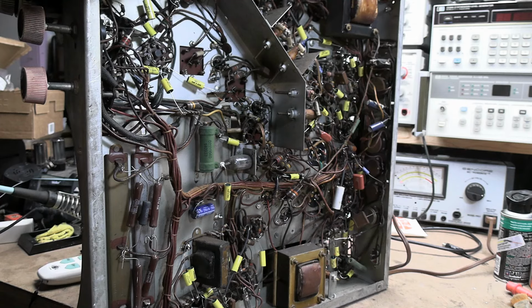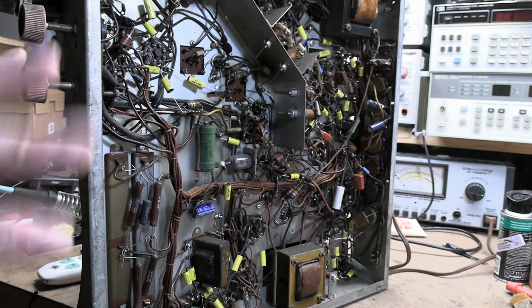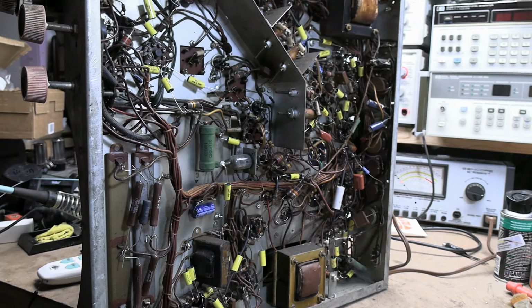The end effect on the screen is kind of neat. I'll show it to you later when I get the set connected up to a signal source, but other sets, when you turn them on, the screen will slowly fade in, it'll take a while to synchronize. This delays power until everything's warmed up, so when the relay clicks, you get a good picture, it snaps in almost instantly. Full brilliance and locked in, so kind of a neat thing. But obviously when this set's really cold, you've got to wait a good 10, 15, 20 seconds before it clicks in. But hey, it's there, it works. Hooray.